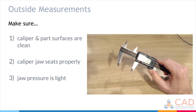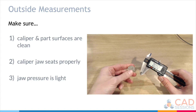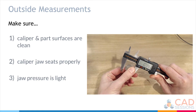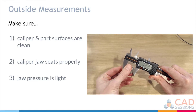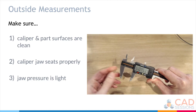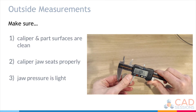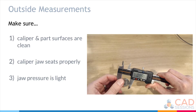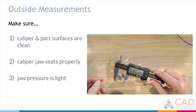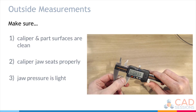Let's take some outside measurements. Here we have a coin — I want to know the outside diameter, so I bring it between the outside jaws and make sure it's sitting straight. Reading: 0.951, 0.9515, 0.951 — consistent, so that's good. Here's another coin: 0.8335, 0.8335, 0.8335.